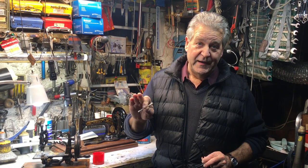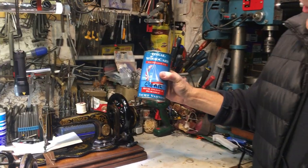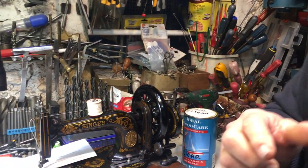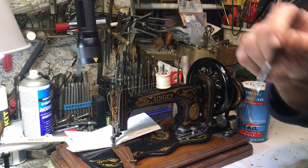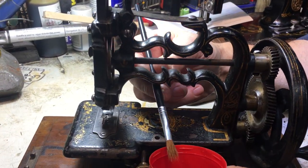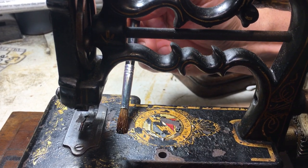Then I let it dry, and what I'll do is mix up some polyurethane varnish — which takes a few hours to dry — with a bit of white spirit to thin it up. Then I get a brush and slowly use the thin mixture. I tease the brush out to make sure there are no loose hairs on it, because that drives me mad.